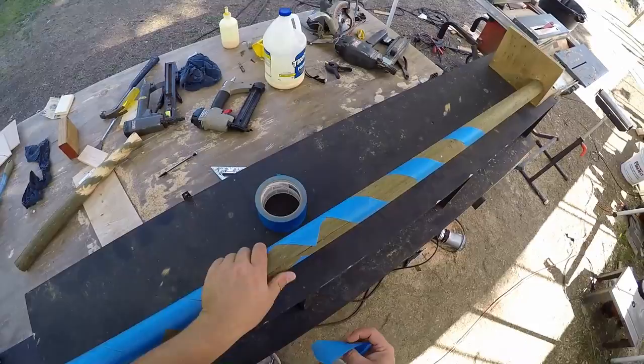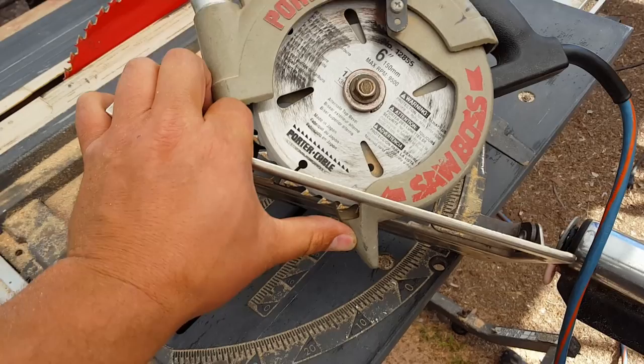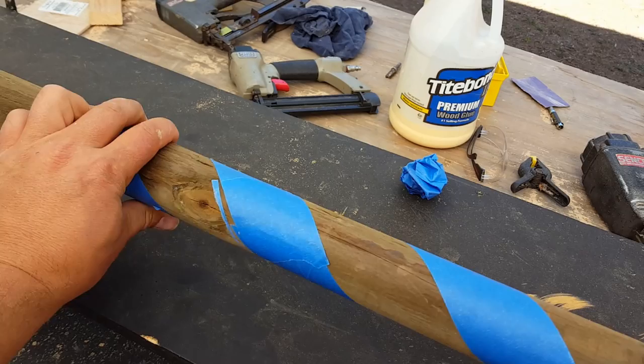So the next thing — if you guys have a battery operated circular saw or one of these little ones, it's really easy to handle. I just set the blade for about a quarter of an inch, or however deep you want your little decoration to go. I don't want to go too deep on this one because I'm gonna be cutting it in half. And what I'm gonna do is I'm just gonna freehand and cut as I'm spinning this thing, basically trying to get as close as I can on the edge of this tape line. You just have to get that groove deep enough to where you can see it once you take the tape away.